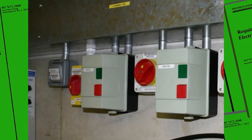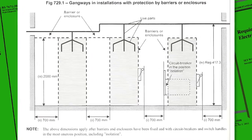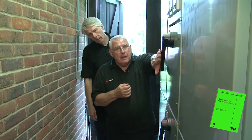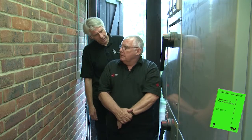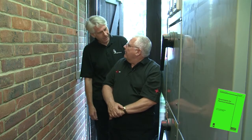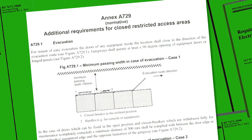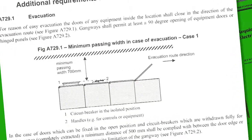Generally, any electrical equipment shall be inaccessible to livestock, and this section provides clear diagrams to show the recommended clearance dimensions. When looking at these diagrams, the dimensions are taken from the most sticky-out bit and not the edge of the panel. That's a new technical term — I've just invented it. Watch out for amendment 2 — yes, it will be there. Allowance must be made for switchgear doors and extractable units; in the open position they must not impede on the evacuation route.